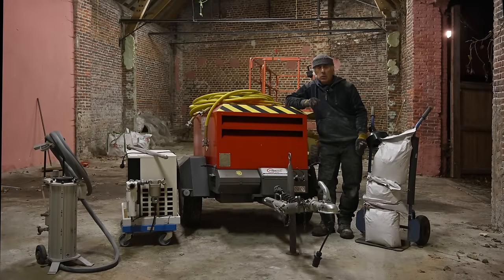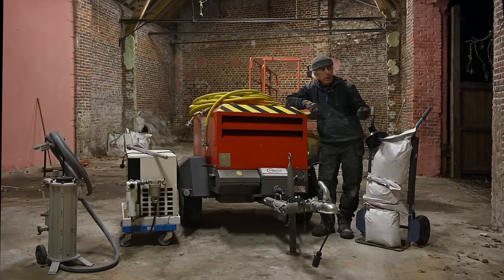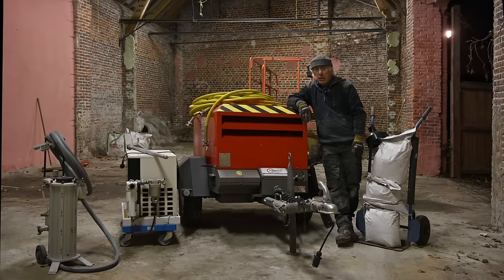To clean up the walls I'm going to shot blast them with Garnet 360, which is a very fine mineral — I have it in these bags here. For that you need an air compressor. The compressor I have delivers about 8 bar, which is more than enough. I might bring it down a bit depending on how soft the bricks are. There are a couple of other tools you'll need. You don't have to own all this — you can rent it. But it really helps instead of using a steel brush, and it gives you a pretty good result.